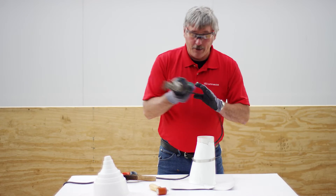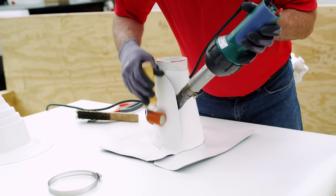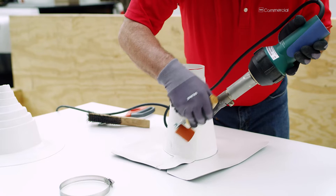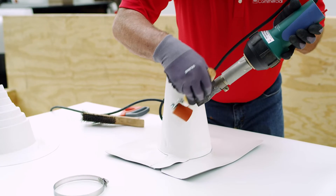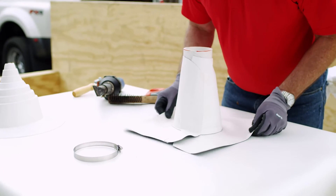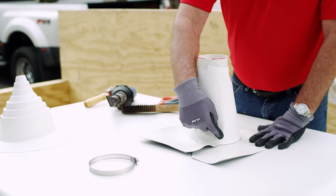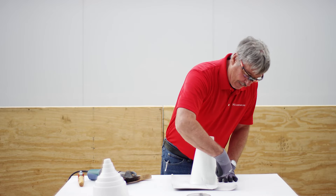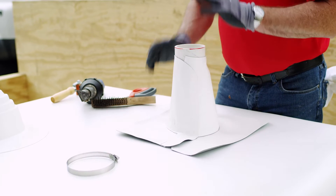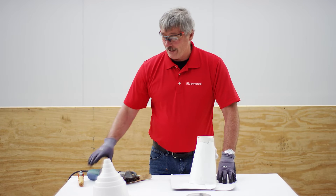All right, once you do that, now you can remove this clamp. Now I want to do this vertical — I'm doing a two-pass weld, basically welding down the whole thing. Once the hard part's welded, slide it back out and do the flat. But if someone probes this and you have a void there, now you've got the same problem you started with — you have nothing to push against. So let this cool down, probe this area, make sure there's no voids, slide it back out, and then it's just a matter of welding the flat down, which is pretty simple.